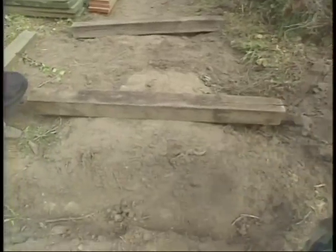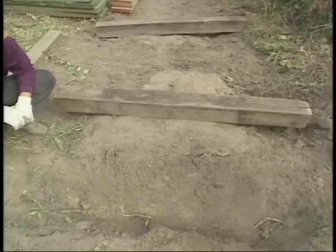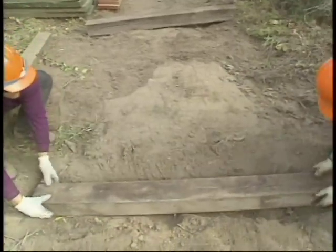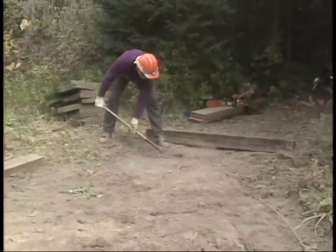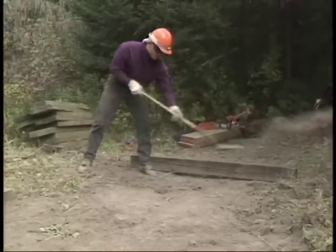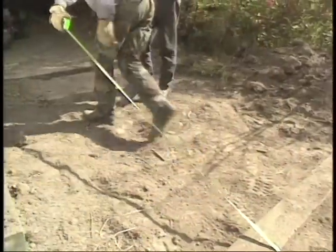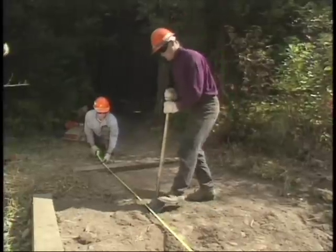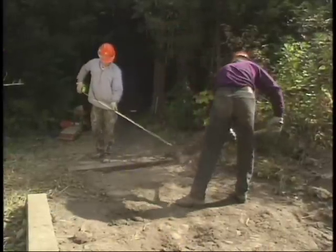Begin the construction of the puncheon by first installing the mud sills. Native logs, treated posts, short treated planks, even precast concrete parking lot curbs are suitable. The sills are laid in trenches at both ends of the area to be bridged, set at right angles to the trail, and be level side to side. Sills are also necessary at 6 to 10 foot intervals between the outside sills. Mud sills should be as long as practical, up to a maximum of 8 feet for best stability.